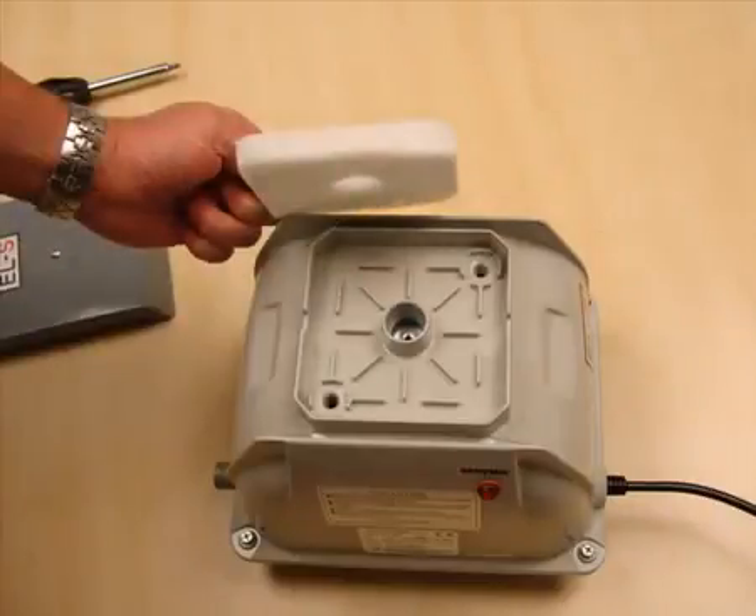Pull out the filter. It's a good idea to do this once every three months or so. The filter should be dry and the only dirt on it should therefore be dry dust or maybe a spider or two. If there are any signs of honey-like residue, this is a sure sign of foul air getting into the pump.